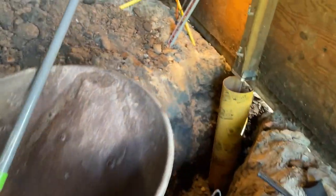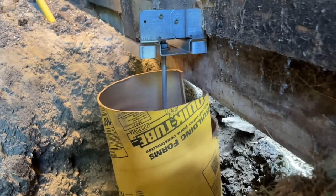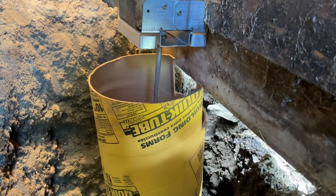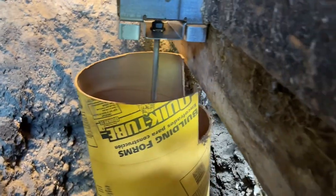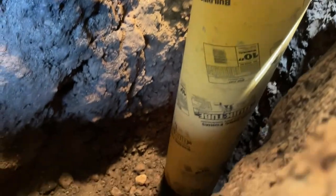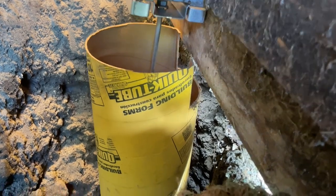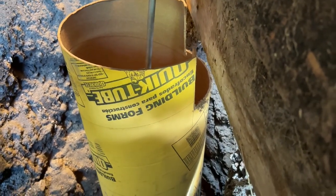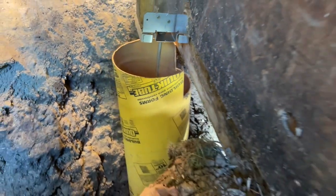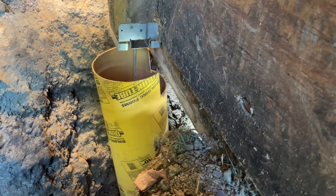I cut above the rot a couple of inches and that ended up putting me right at the top of that outside plate - that plate is not rotten, believe it or not. So what I did is I got these post mounts - I can't remember exactly what they're called - but they have the space and the anchor bolt. I put that onto the post, dug down, got my sonotube down there, got a rebar down on the ground to keep the bottom from shifting, and then I notched the sonotube out.